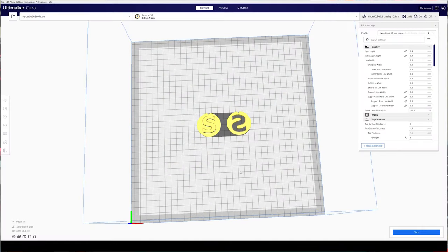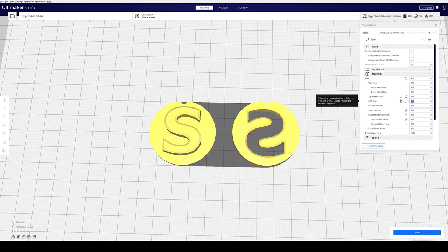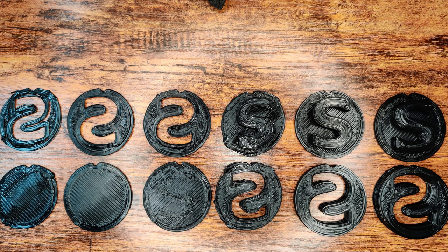This is one that a lot of people don't know about, but I highly recommend. By using this simple model, you can make your prints much more accurate. The way it works is that we print out the model and see if the two pieces fit together. If they don't, then we adjust the material flow rates — typically somewhere between 90 and 100 percent — until they fit. Really spending some time fine-tuning this will make a huge difference in consistently getting accurate parts that fit every time. There's also a second part to the S-shape test: it can be used as a general test print to see if your prints are wobbling to the side or if you have layer shifts. So when you get to this point, it can be a good indicator of whether you've got the other steps right, like tightening the belts.